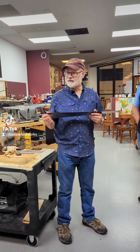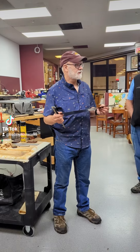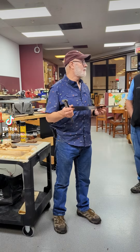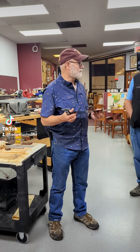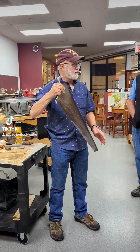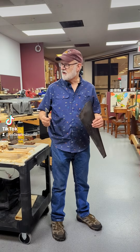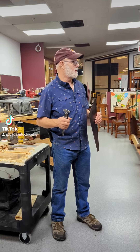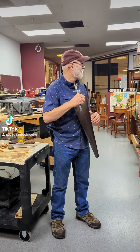What a lot of people don't think about is plate gauge itself. All saw plates vary in plate gauge — the thickness of the plate. The thicker the plate, the coarser the teeth, the bigger the saw, the more robust the cut requirement is for timber framing or ripping. If I'm sawing redwoods, I don't want a thin plate.